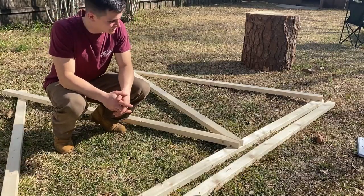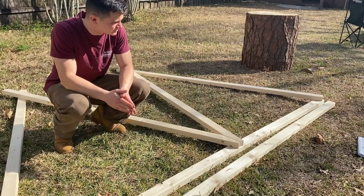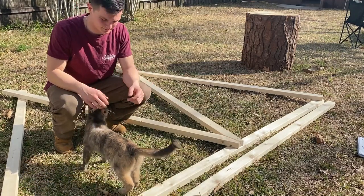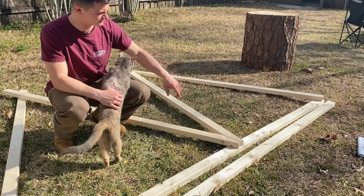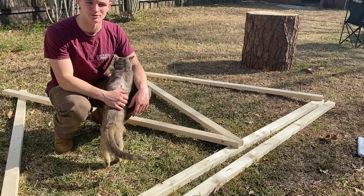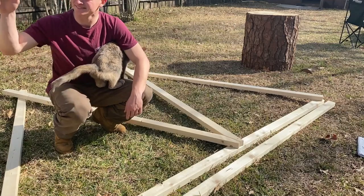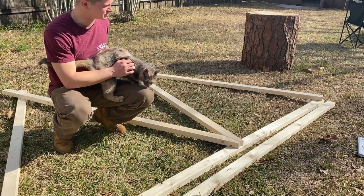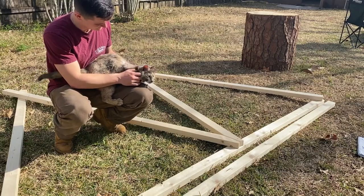So I'm actually having a hell of a time putting together these sawhorses. The math I did on the front end, I thought would work out, but no, it's not. Go figure. So what I'm doing now is running a screw into the bottom of each of these 2x3s so that they can rotate. And I'm pinching them together in whatever way is gonna give me a vertical height on the sawhorse of 70 1/2 inches. And then I'm gonna drop another 2x3 on top that'll make me a full 72, which is my interior height in the trailer. And then that square piece is gonna fit on top of that. But yeah, I thought this was gonna go a lot smoother, but I'm pretty much winging it as I go. I'm not looking for a perfect result, just something that'll work, you know? All right, get off.